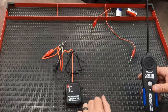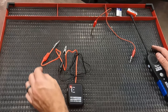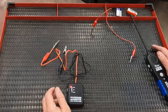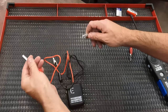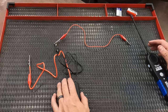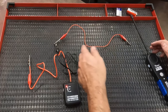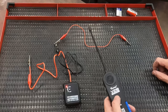Let's flip it back to tone mode. This is the one that has the biggest value for me — when you have a wire you're trying to trace. You can hook one end up; it doesn't need external power, it's self-powered with the 9-volt battery. It generates a tone out through that wire, and this receiver and antenna picks up that tone.